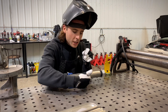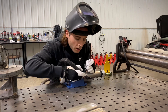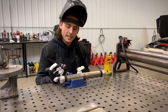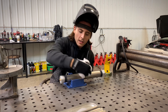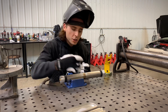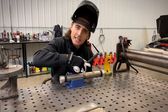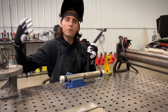The fast way is if you want fewer start and stops — you can start way down here and do 20 or 30 dips before you stop. The downfall to the fast way is that the nozzle can't keep gas coverage over that whole stretch you just welded while it's still molten. It's still going to be strong and look good, but you're going to have a blue or purple hot spot in that weld, because the back edge of the nozzle passes the current molten weld and can no longer shield it until it's fully cooled down.